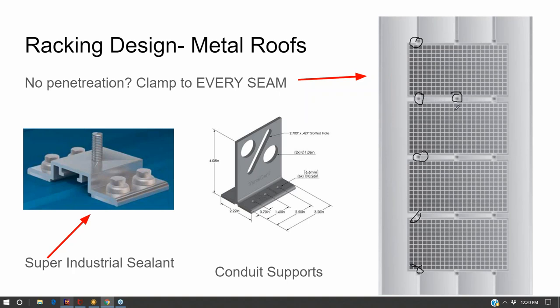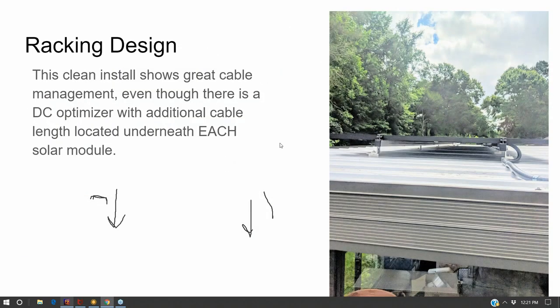Yeah, so kind of ironically, the standing seam metal roof is like the weaker roof to attach solar to. The better way to do it is just to get a rolled metal rooftop, which is a little bit cheaper, and then use a metal roofing screw to just screw into the rafter. And there are specialized attachments that come with butyl tape underneath them to make sure that that roofing screw is watertight. And that's really what we should have done on this project right here.